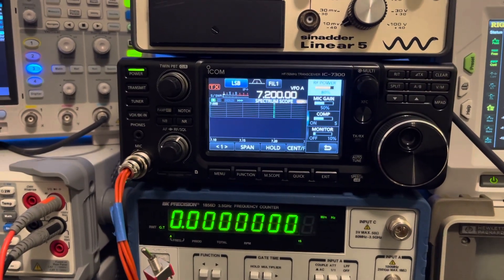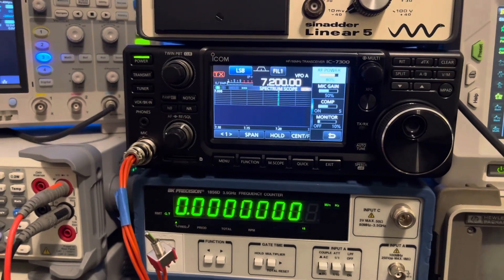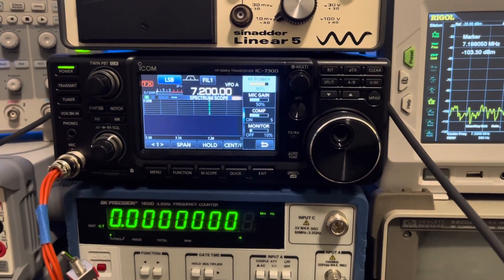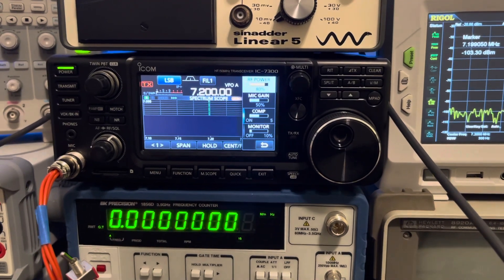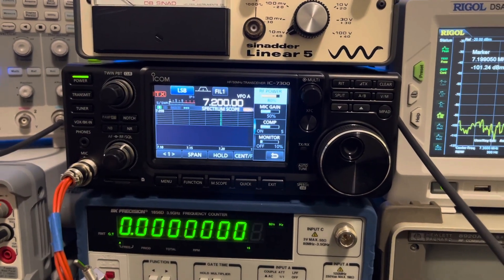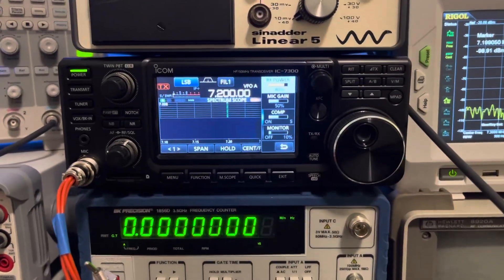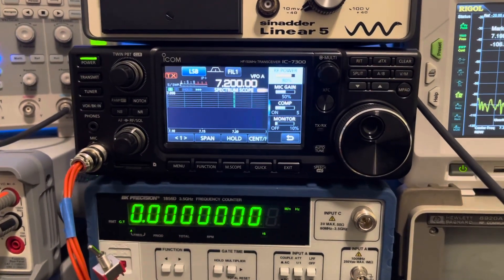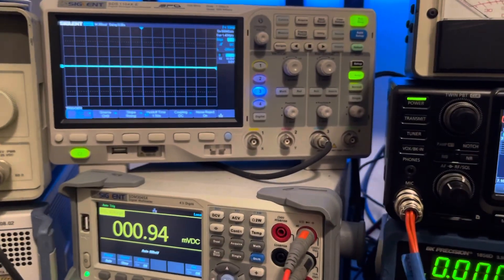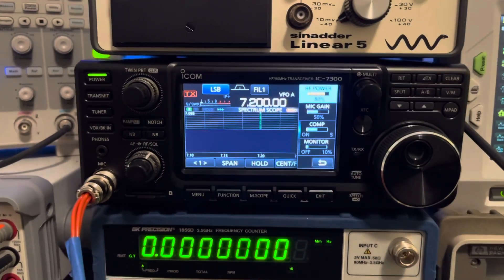I just wanted to show that it's got a very clean output signal. If you were basing this on the CB services — Part 95 — you're allowed a lot more leniency: just 25 dB down in attenuation for spurious emissions within 8 kHz of the fundamental frequency. But Part 97 for the amateur bands tightens up that standard considerably. If you run your power at about 40 watts or higher out of the radio, you're not going to have a chance to meet Part 97.